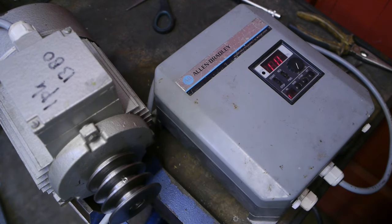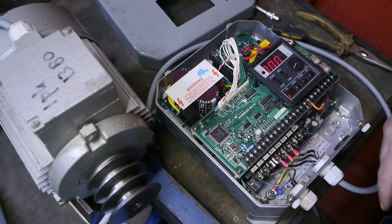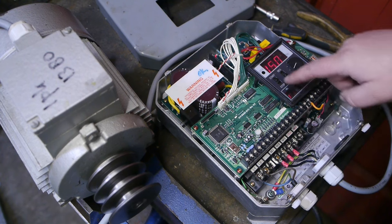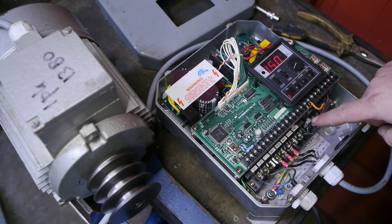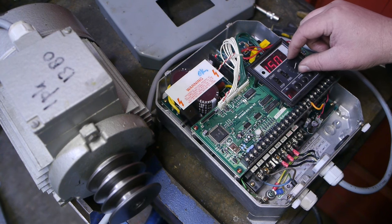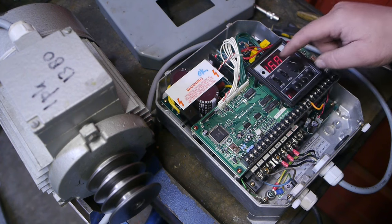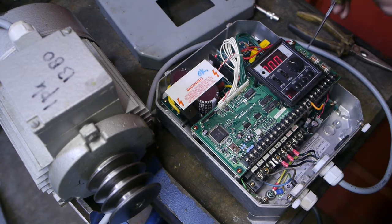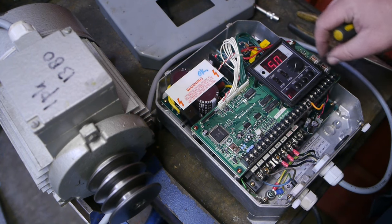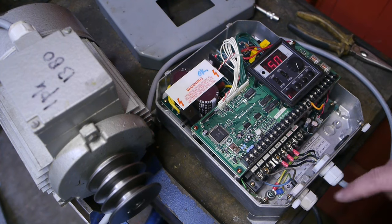It's not the bearings — something is clearly wrong here. Lucky me, I've got three or four more of these things. After messing with the cables a bit it starts to work again. Looks like the minimum is set to 15 Hz; I'll set it to 5 Hz.